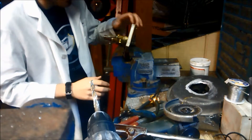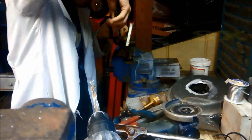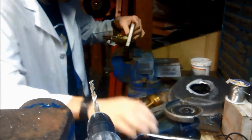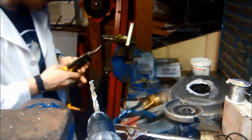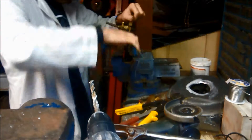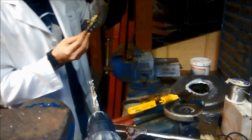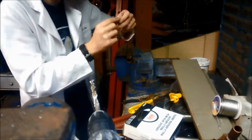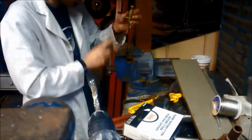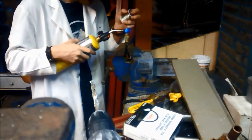I'm just going to remove the valve stem. Using tin snips and a pair of pliers, I was able to successfully remove the access valve from the piece of sheet metal. Since this line is open on two ends and we only need it on one, I crimped one end down in the vise. I applied a liberal amount of flux to the end, put it back into the vise, and soldered it shut. Now it is fit for use with a vacuum chamber.